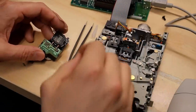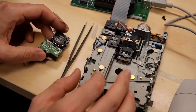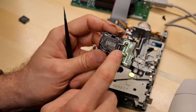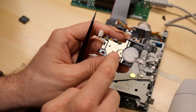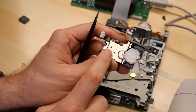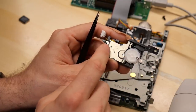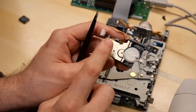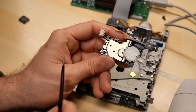Servicing involves taking the drive apart, cleaning the old lubricant off, re-lubricating it, and putting it back together — pretty easy once you get the hang of it. One of the biggest problems with these drives is the eject motor and gear assembly. This is the motor and circuit board, and under this metal cover are the eject gears — a whole gear reduction system. There's a gear attached to the motor that always fails. It may have a different material than the rest, which I think are nylon, probably designed to fail so it won't strip all the gears. Over time it decays, becomes brittle, and breaks really easily.